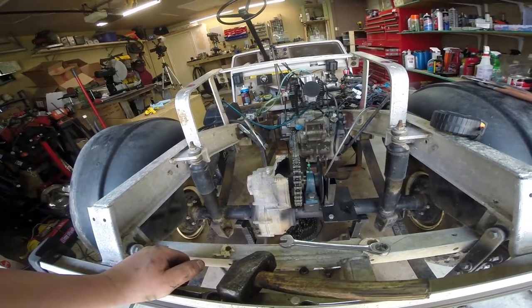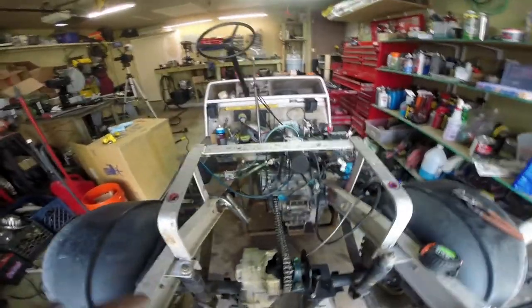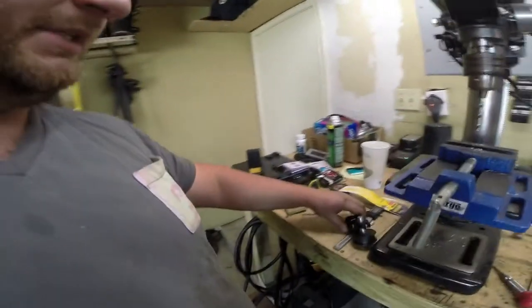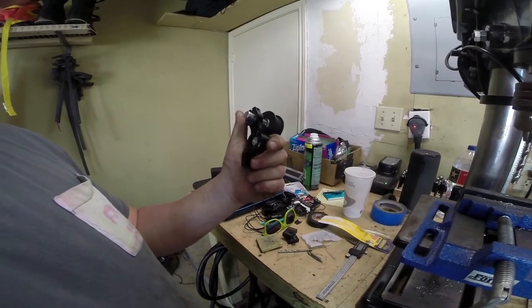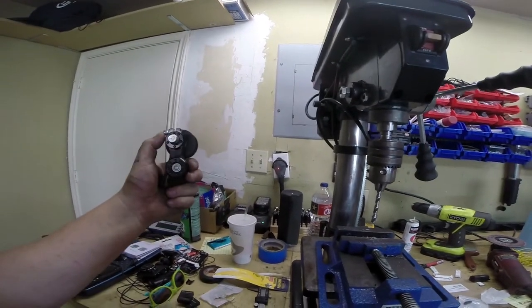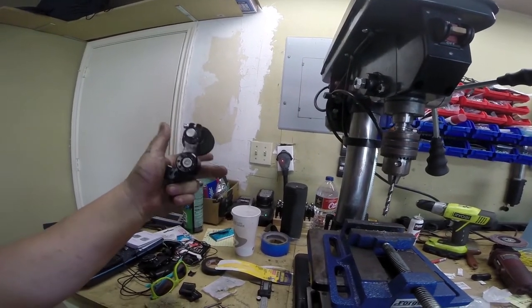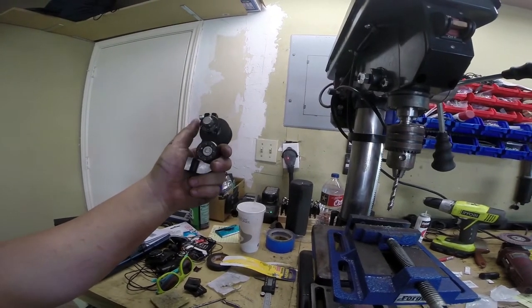Next step: I'm going to run a piece of tube steel straight out underneath the chain, and then another piece of tube steel straight up — that's basically the tensioner assembly. The way it works is there's a spring in here that flexes up and wants to snap back. When it's fully decompressed, this part will be perpendicular — vertical — so it's going to be pushing up almost two inches.